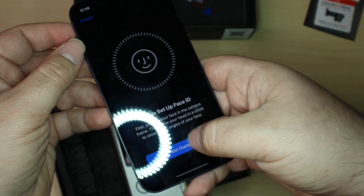Maybe you're working on a phone and you damaged the proximity sensor, or it's been water damaged and you have a three minute boot loop. Maybe the cable got punctured, or some component on the proximity sensor assembly has failed. Typically this means that you either replace the component and lose Face ID, or you go through a tedious process of soldering over the proximity sensor to an original flex to restore Face ID.